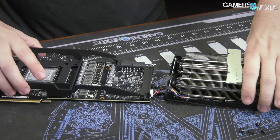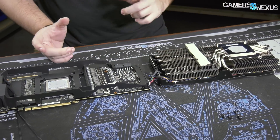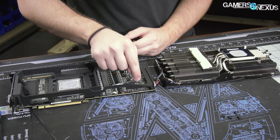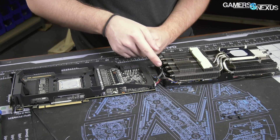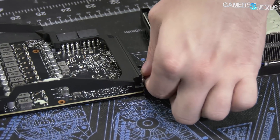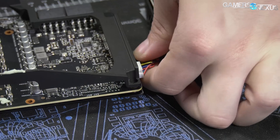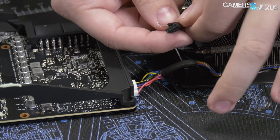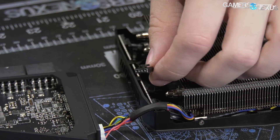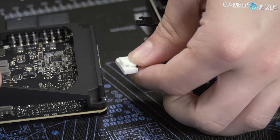This is something I already like about the card. On some cards like EVGA's, fan headers that are vertical into the board with really short cables are problematic — you get it a quarter of an inch off the card and then have to disconnect cables. This one just flips open, which is really nice. The power connectors also have an actual push-release latch, which is not standard. We have broken the more standardized power connectors in the past, but that's not a problem here.